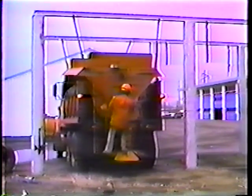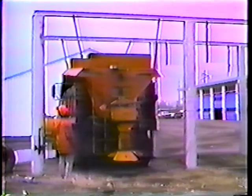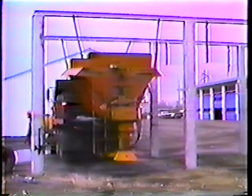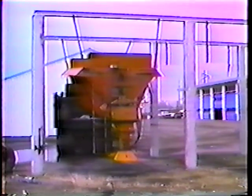Be sure to grease the conveyor sprocket too — it's between the cab and the sander, so you might find it easier to get to after the sander is unhooked. Then back the truck in, raise the bed, hook up the chains in front, hook up the chains in back, and lower the bed. Before you drive away, double-check to make sure everything is unhooked. And that's it — you can be sure the sander will be ready the next time you need it.